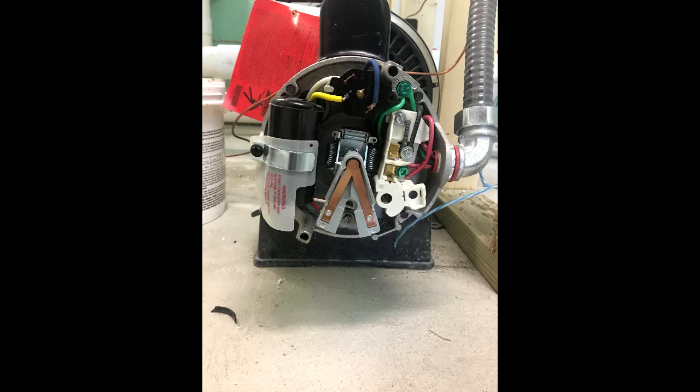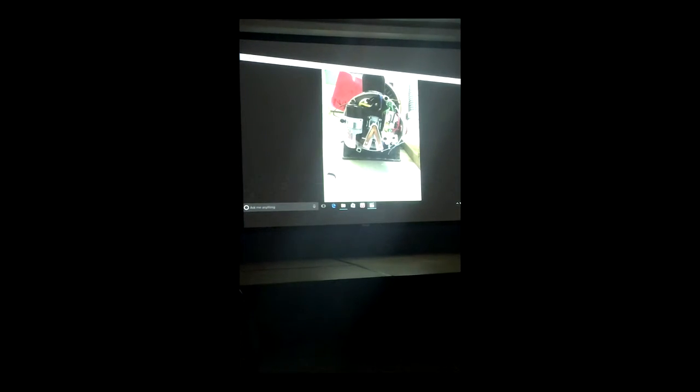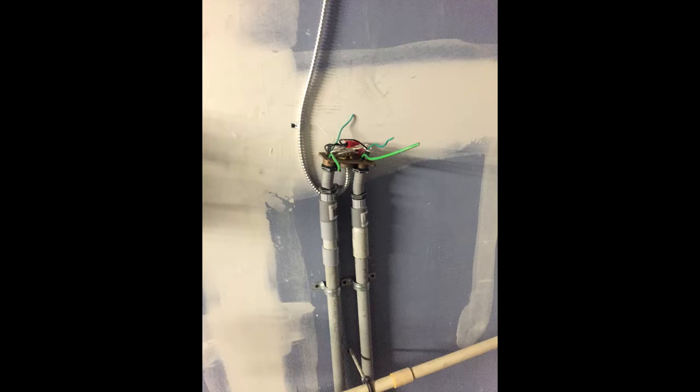This is another one of my pumps. I turned it on and it ran really high and blew. I took it apart to see how the electricians hooked it up. On this brand new pump they already lost the screws, so they put a round screw in there. Right here's the pigtail and they left all this extra length on it — it got caught back in the shaft. It started rotating and pulled on it and blew it.